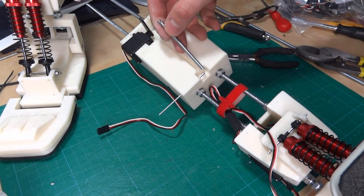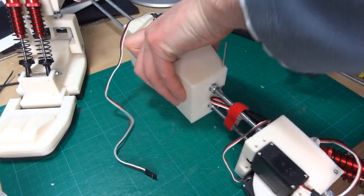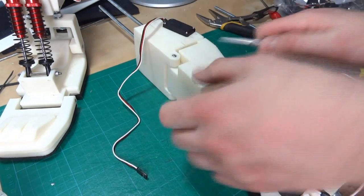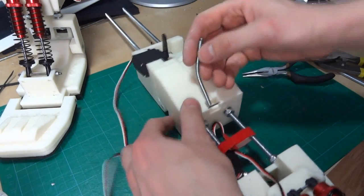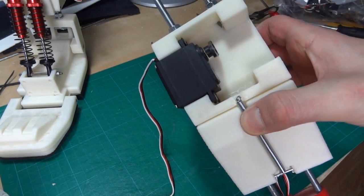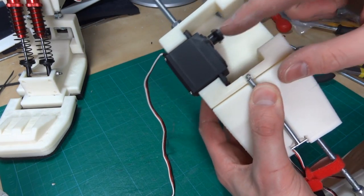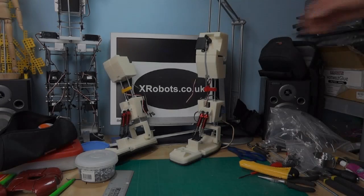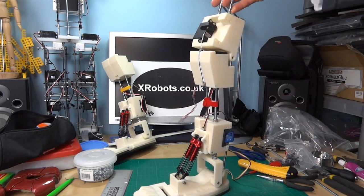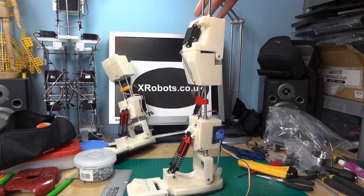I've left this anchor point here which is a 2mm hole so I can just hook this spring on and push it all the way down with a pair of pliers. The spring is securely hooked there, and the other end goes up through a channel I put in both pieces. We just need a linkage to attach that to the servo horn. I've wired the linkage with a piece of wire to the servo, so as the servo releases the knee can bend back. I've also glued a bit of foam in there as cushioning — a bumper or buffer.